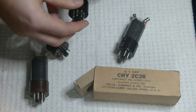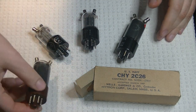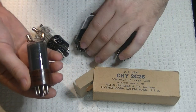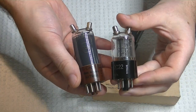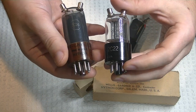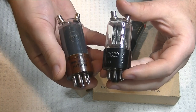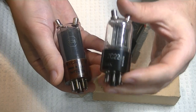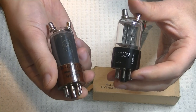Ask us how we know — bad things happen in a hurry when you do that. The 2C26 has a lot of similarities to the 2C22. They look very similar, although the 26 is obviously a little bit bigger. They both have an octal base, double top caps, and a lot more similarities on the inside. They're both medium-mu — that's amplification factor — single triodes. While the 2C22 has a mu of 20, the 26 is a little bit lower at 16.